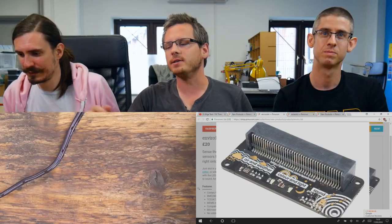So the clear gives you your total ambient light level, and then you can scale your individual colour levels against that to get the proportional amount of any given colour, which lets you convert it into an RGB colour value. When you talk to it, you basically pull off a red, green, blue, and clear colour value. Then there are some crazy calculations to convert that into lux, if you want to use it as a lux reading. Should we get out of the zoomed camera because it wobbles every time we touch the table? But it's kind of interesting to look at how the sensor's structured.